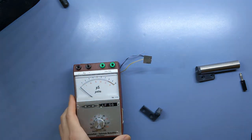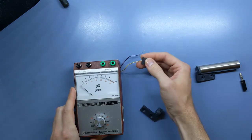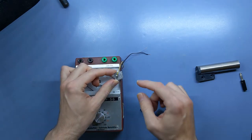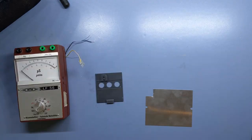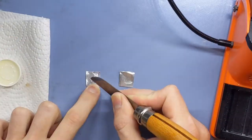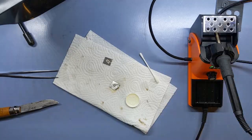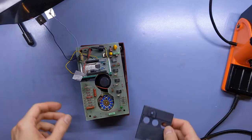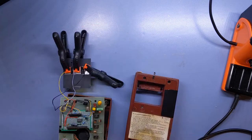Soldering to aluminium is not the easiest. Its protective oxide layer prevents a proper bond with the solder. If we scratch the protective oxide layer, it reforms instantly. What we're going to do is soldering while excluding oxygen to prevent it from reforming. For this, we are going to cover the piece in vegetable oil, scratch away the oxide layer, and then heat the aluminium until the solder melts to it. Afterwards, we can solder a wire to it.